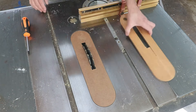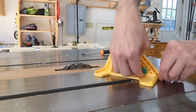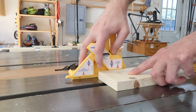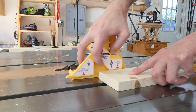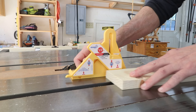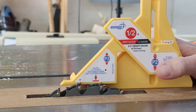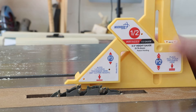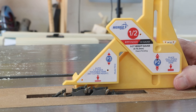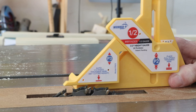This is called a Fit Finder from Micro Jig and it does one job really well — it finds the center point of a board. I put the board under the sliding part, drop it down, and the horizontal part shows the exact halfway point so I can move that over to my dado stack and raise the blade to just barely touch it. This is perfect for half lap joints because finding that exact halfway point is really important so that the two pieces match up and are flush. I'll include an affiliate link in the description if you want to buy one.